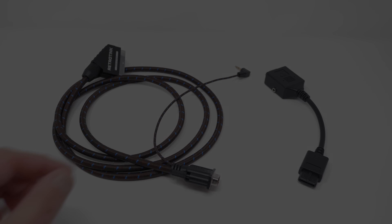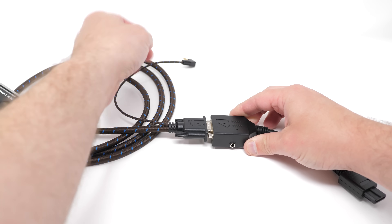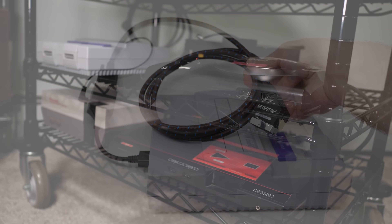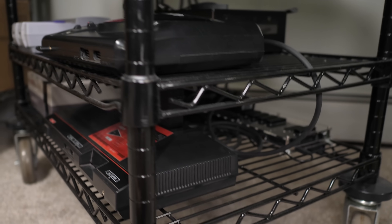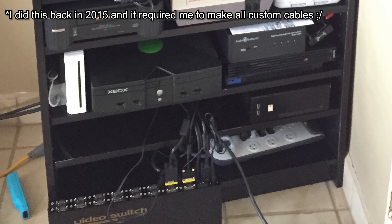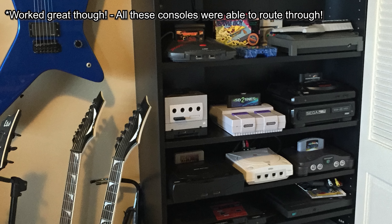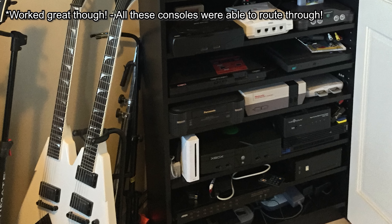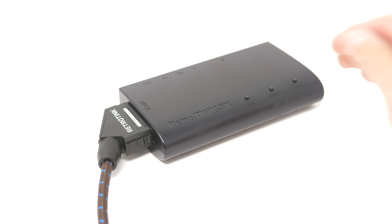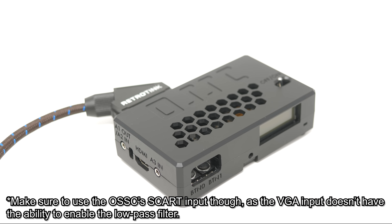Now that you know what these are, let's briefly talk about use cases. You could simply get the matching SCART cables and treat them exactly like RGB SCART, and if you already have a SCART setup, these would make a great addition. But what about some alternatives? People with access to cheap VGA switches might prefer just using VGA cables for the inputs, then adapting the output of the VGA switch to whatever cable type they'd like. If you're then going from that VGA switch into something like a RetroTINK 5X or OSSC, using the RetroTINK's HD15 SCART cable on the switch's output side is all you'd need to connect it to SCART equipment.